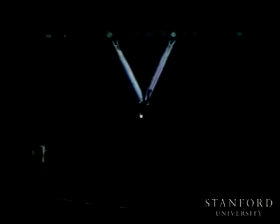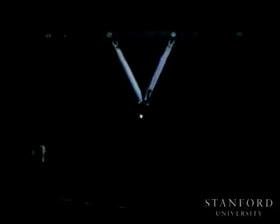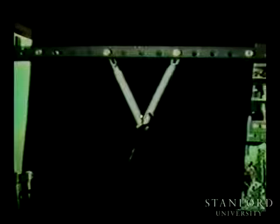The posture of the robot is measured by gyroscopes built into the arms, and the joint angles are measured by encoders. The robot is calibrating its gripper position and closes it when it approaches the target bar. This motion is so-called the underhand motion. The robot can perform another motion called the overhand motion. This motion is naturally more difficult than the underhand motion because the robot has to stop the turning of the arm against the gravity force, and the movement is liable to become unstable. However, our robot also succeeded in performing continuous overhand locomotion. It needs more torque than the underhand motion, but this is more efficient motion with respect to time and energy consumption.